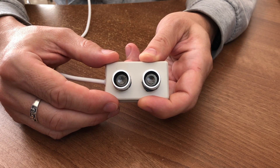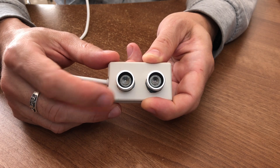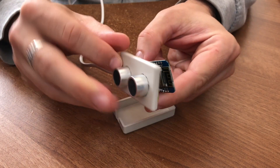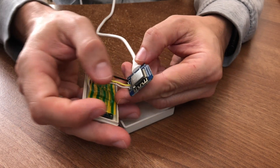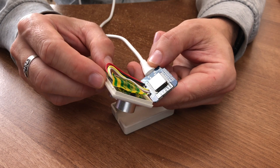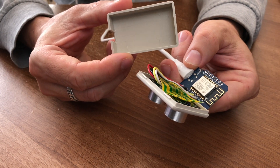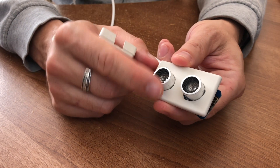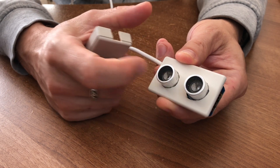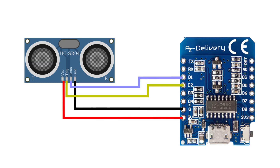This is almost exactly the same as the ultrasonic motion sensor, only this time I've renamed the sensor entities and adjusted a few values. Starting with the hardware — I'm going to open it up here. I've used a D1 Mini and an HC-SR04 ultrasonic sensor, with a bit of tape over it to stop it coming in contact with the metal on the D1 Mini. There are a few Dupont cables with the ends cut off and a nice slim project case. I've made a couple of holes in the case for the ultrasonic transmit and receive to poke out, and another little hole on the bottom for the USB cable. The wiring is also identical to the motion sensor wiring, though this time I've directly soldered the wires to the components to save space and use the most compact enclosure possible.